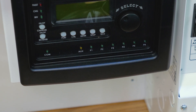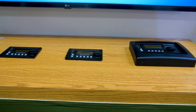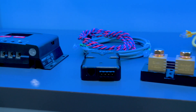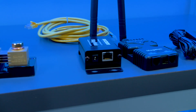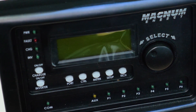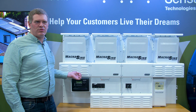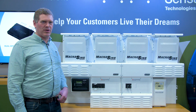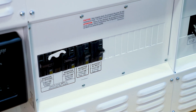The advanced router provides the interconnectivity for the parallel system, as well as acting as an aggregation point for control and setup of all of the inverters and other Magnum accessories — such as autogen starts, BMKs, or using a MEARC as a remote system display. For example, if you had the system set up 50 feet away from your primary dwelling, you could extend the display with a MEARC remote to somewhere more convenient, such as a storage area or utility space.